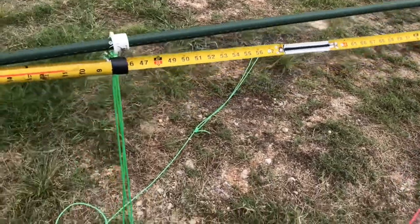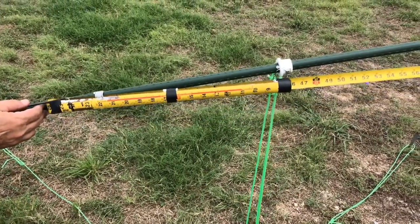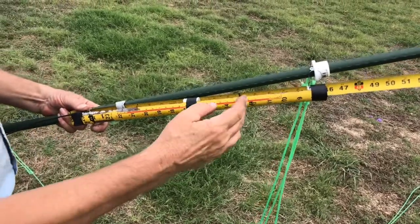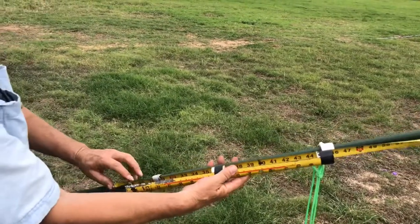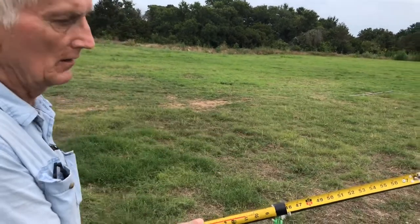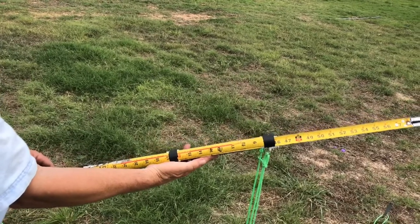The overall length from the base to the tip, I believe, is 57.5 or 58.5 inches. The matching stub is 19.2 inches from the bottom to the bottom of the curve, and three times that is your overall length. You've got low impedance at the bottom and high impedance at the top. On a dipole the ends are high impedance and the middle is low impedance, so you match between the high and high — that becomes a dipole. This part is actually three-quarter waves of UHF, whereas it's one-quarter of VHF. It's pretty simple, actually.